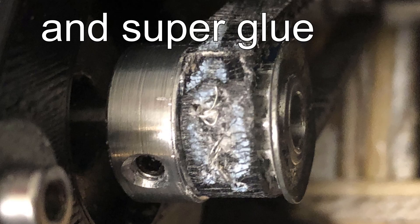I can get a straight piece of pipe, but to keep it concentric I'll have to drill mounting holes dead center in the material, and that's way easier said than done. In the same vein, the belt I'm using to drive the roller has to be replaced. I used some thin wire to stitch the two halves of the belt together to make one loop, and that made a huge bump on the back of the belt. It's so close to the edge of the print bed that it rocks and bumps whenever it hits, so I need to do something about that.